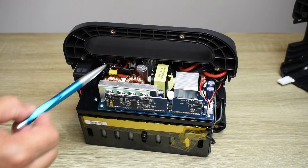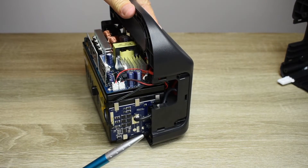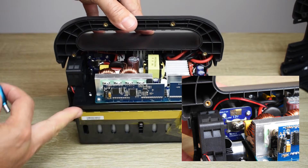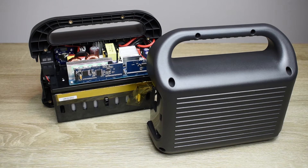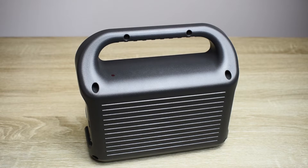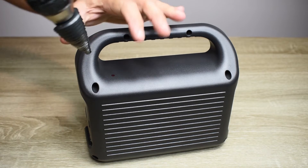You can see the top board over here — this is the inverter board. Down here is your battery bank, and right over here is your battery management board. What I'm going to be tying into is right back here where it says 12V, with a red wire leading right into it. On this Jackery Explorer 240, this area right over here is wide open, so it's the perfect space to drill a hole in the cover to mount the switch. I think I'm going to position it right over here so when I'm holding the unit I can push it with my finger.